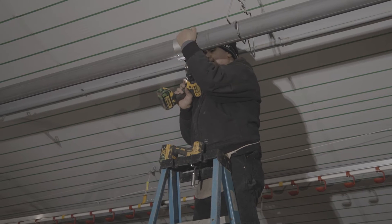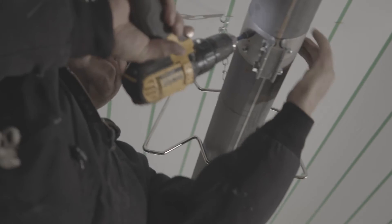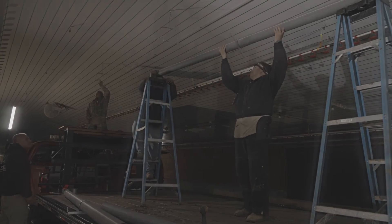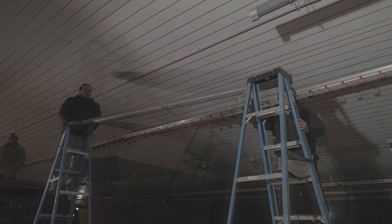You can now completely tighten both bolts on the band clamp. Next, install the self-tapping screws into the two outside holes in the band clamp — these screws secure the tubes in place. Now repeat these steps when installing the remaining tubes until all the tubes have been installed.